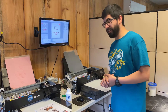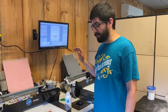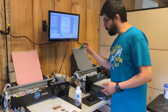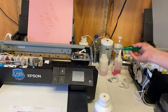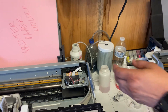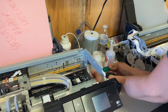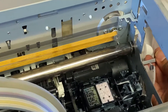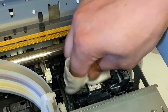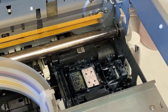The first step when turning on the printers: make sure that the day before you have it wet capped — it's extremely important that it's wet capped. Before turning on the printers, go to the back and use a Phillips screwdriver to turn the wheel for the capping station to the right until you feel and hear a click so the head can move. Continue turning right until you start sucking all that capping station fluid and cleaning solution. Then turn it all the way back so you can see the wiper blade, make sure it's clean, and clean around the capping station, around the suction, and the wiper blade.